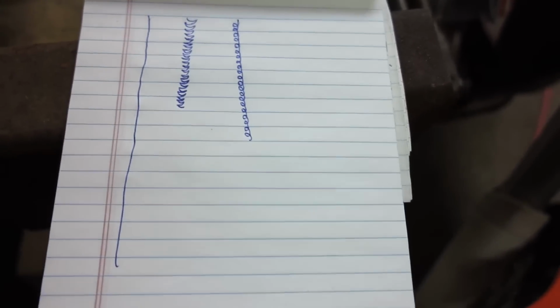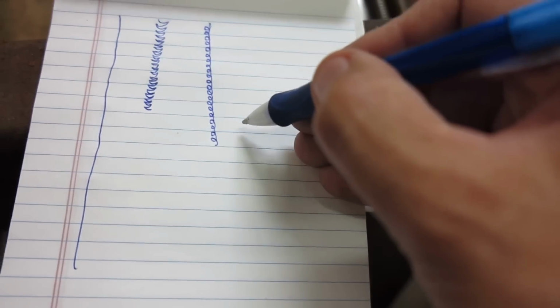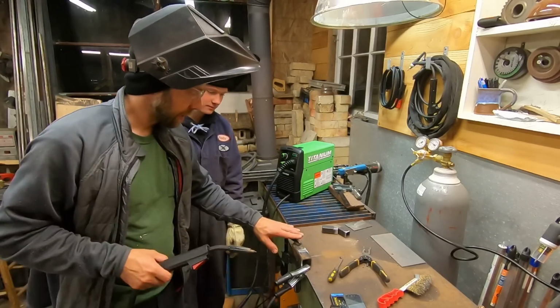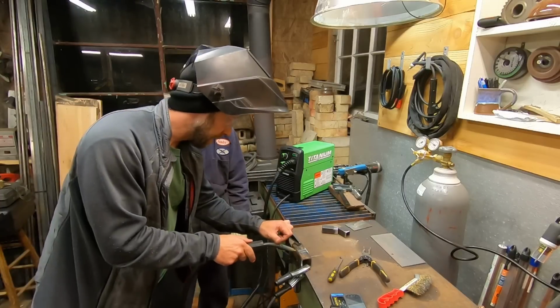But we're not too worried about that in this video showing Liam how to practice welding. Mainly want to make sure he has a stick out right, consistent off the workpiece, and consistent feed speed, so he's not going too fast. All right, Liam, so what we're gonna do is you're gonna want to come in here. We got our workpiece clamped down pretty well. We got the ground on here. You're gonna want to come in and you're gonna want to tack weld the corner.